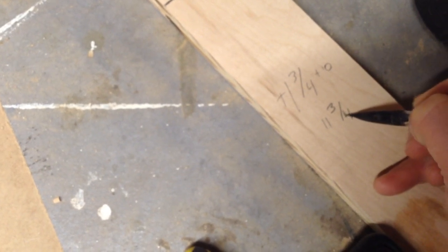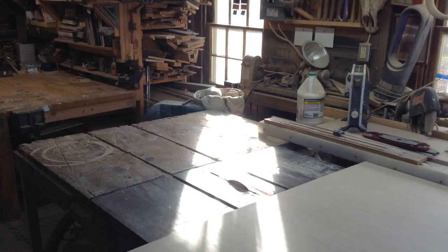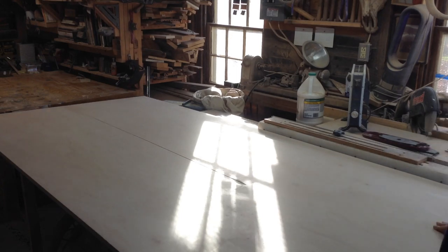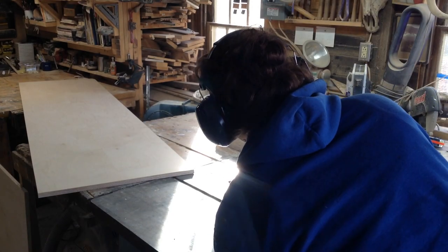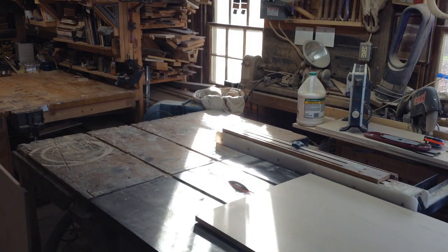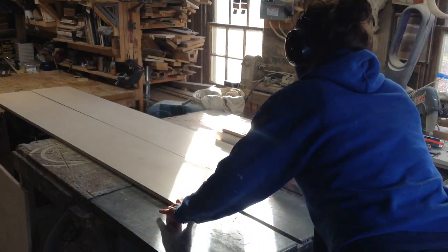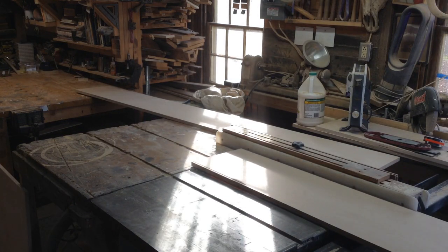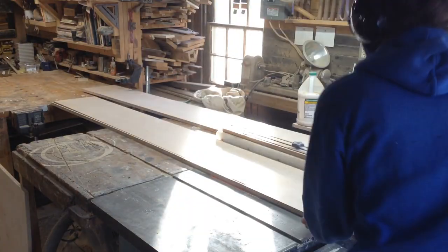This is the opening for the vent and then the height of this is a little bit over 68 from the wooden plank up to the ceiling — 71. So I have about 10 inches plus a little bit, that one and three quarter, which is what I go over. So it's 10 inches from the top of that panel and then I'm one and three quarter from the ceiling. So that panel I can cut — I wanted a little less than that, so I'm cutting it at 11 and three quarters. Now this whole room is a little over 13 feet long, so I'm going to have to splice two panels together. So I'm cutting both of these to 11 and three quarters.